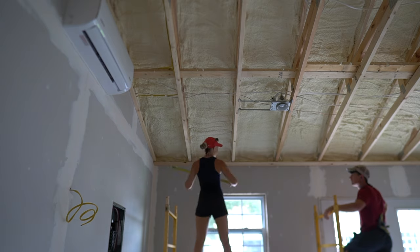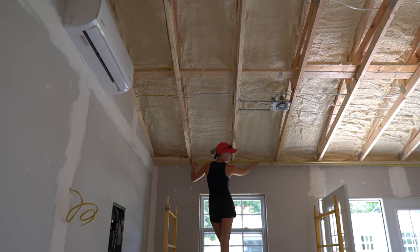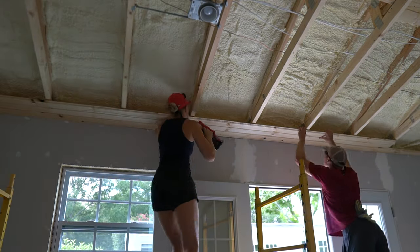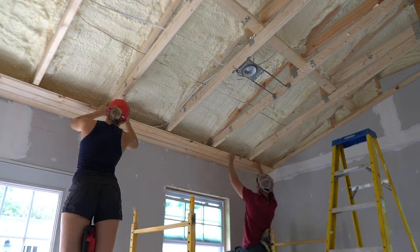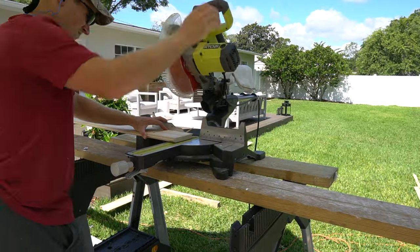To determine the length of the board, you need to measure to the center of your stud or truss so that each end of the board has something to secure a nail into. Before cutting your boards, check to make sure it's not extremely bowed or damaged. These boards will be near impossible to install or may create large gaps that aren't uniform with the rest of the boards. Be sure to square cut each end of the board before installing it.